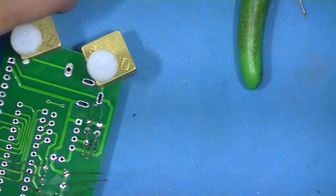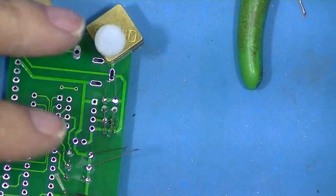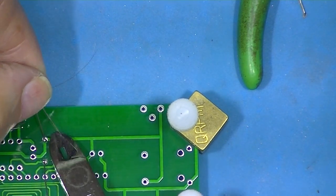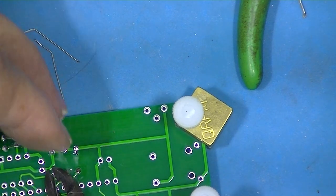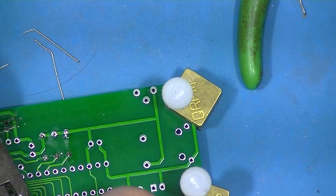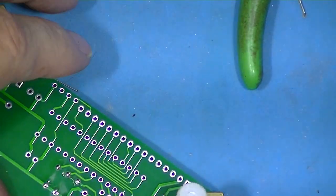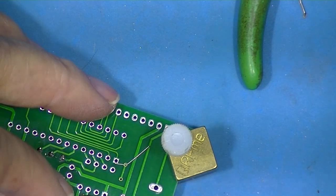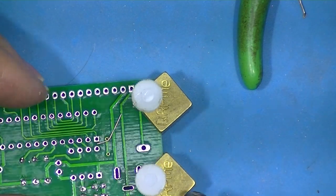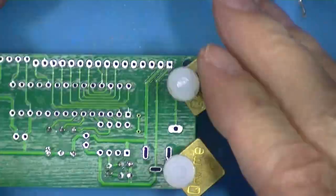Don't cut the leads too close. It's better not to have flush cutting tools here. You may actually nip off the joint. Should wear eye cover in addition to holding these little pieces, they tend to fly. Inspect your work. If it doesn't look like it's been soldered, reheat it, perhaps add some solder.